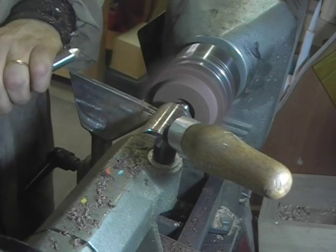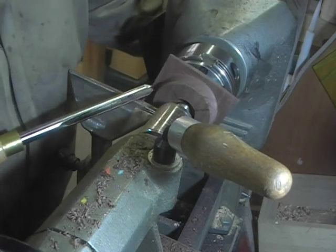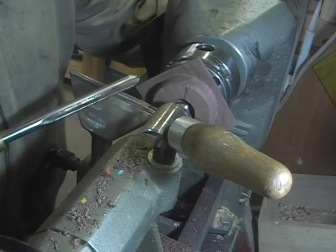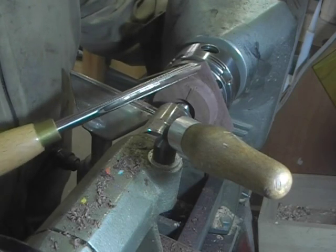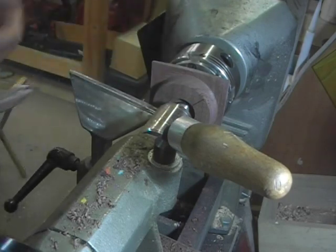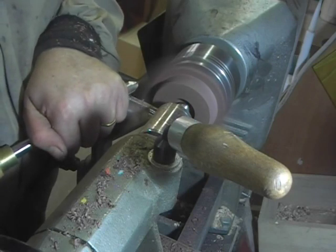And I had to remove the material because if you don't remove the material, when I get into here, the gouge runs in, and of course that's going to be not a fun day. Still a little bit fat here compared to out there. That's thinner and that's fatter, so I got to still remove more out of the center, but I still have a little bit of room to go on the outside edge here.